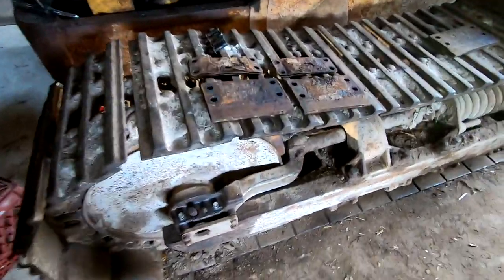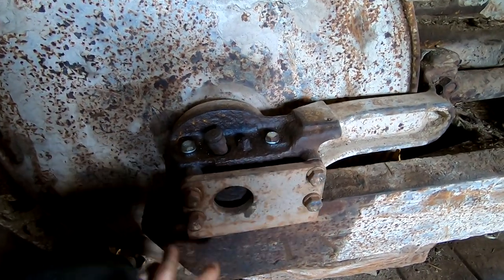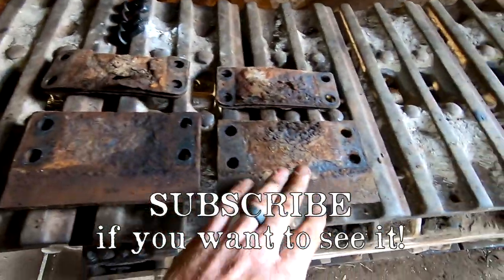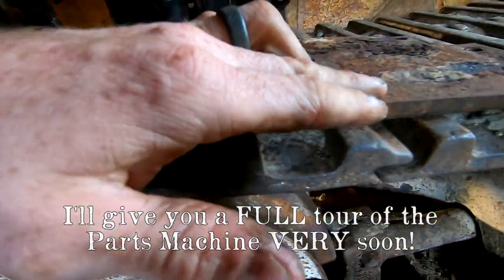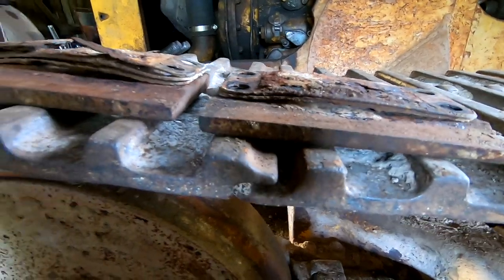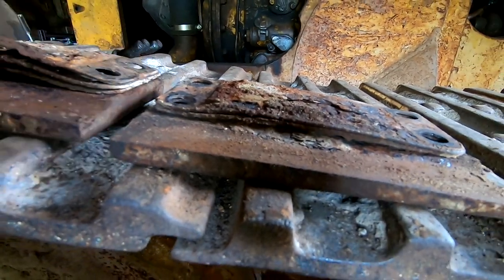All right, so on the wobbly track situation, here's what I found out. On either side of the bracket that holds this front idler onto the roller frame, there is this flat plate. This particular plate is actually off of the parts machine. Basically, it's an extra plate that I found. And these are the two plates that were on it. And right here, you can see it's basically worn into this over the years. But the other problem with it is that it had these shims. And the shims were kicking the guides, these guide plates, out a little further away from the actual roller frame. And between the shims and the wear on the plate, there was basically like a half an inch of extra space